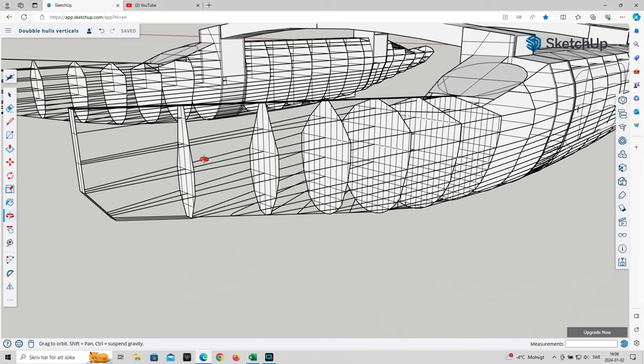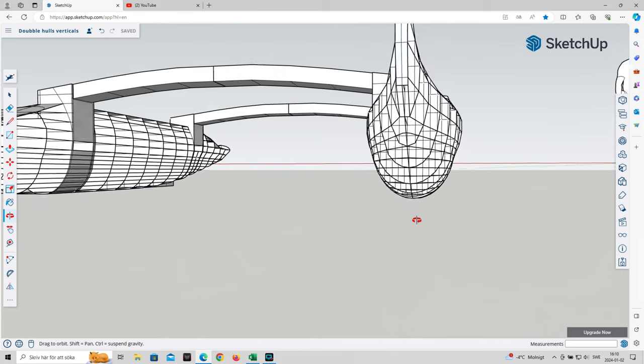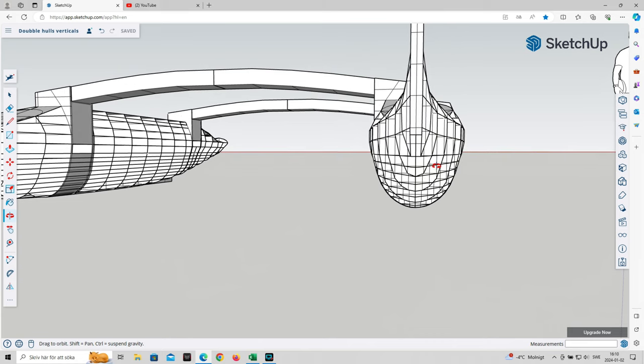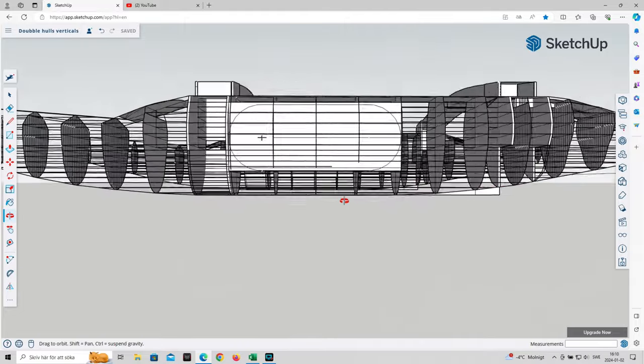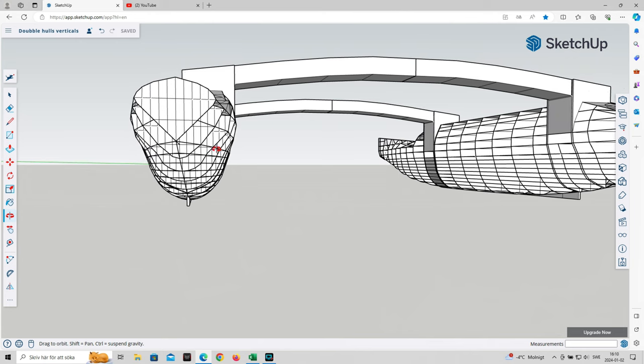The hull shape, generally to get low drag resistance, I have made the hulls spherical, with a spherical shape roughly. Some modification here in the front, they are a little bit extended on the vertical line to take waves better, and in the aft end, they are a little bit outfalling above the water surface to handle high speeds better when the aft end sinks down into the waves.